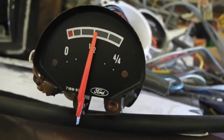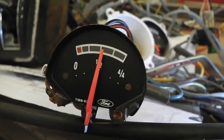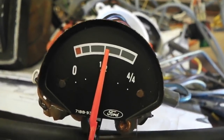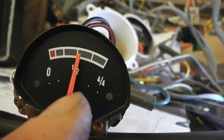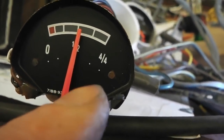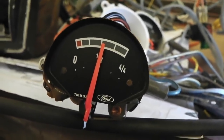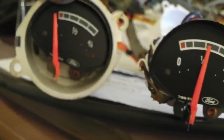Now, what I'll do, I'll disconnect this gauge. I won't touch the sender, so we'll see where the other one parks. Here we go. So we're going to accept that it's just over the white, and just over the first calibration dot. So you would think that if I try and bring the gauge across any more, that it's going to chop out the halfway. Assuming that's correct, let's see if it is correct by getting this gauge and hooking it up. Then I'll show you the calibration screw that I used.